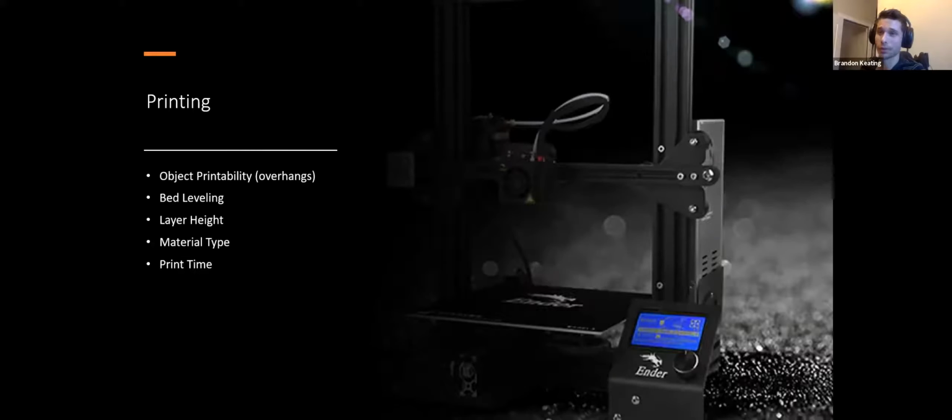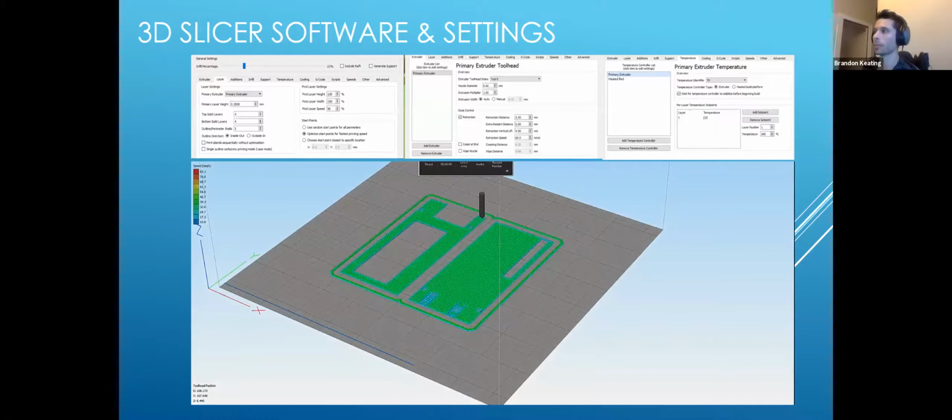Height also, if you wanted to do just something this thick and 2 feet tall, you're probably going to have a problem, because by the time the printer gets all the way up here, the little bit of plastic that's sticking it to the bed might not be enough to hold it in place when the nozzle is actually laying layers down on the top. So things can break off, and then it's a 12-hour print right out the window.